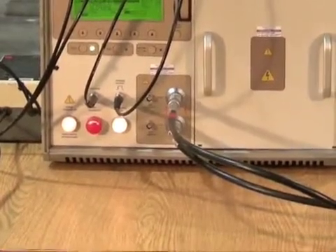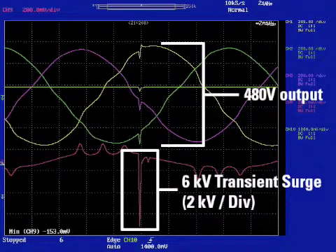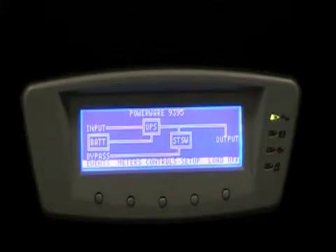Now we end the test. Here we want to describe a feature we call high alert mode. In the event of an approaching storm or weather disturbance, nearby construction, or in-building maintenance that may affect power quality on site, we want to place the UPS in double conversion mode until the chance of power disturbances has been eliminated.